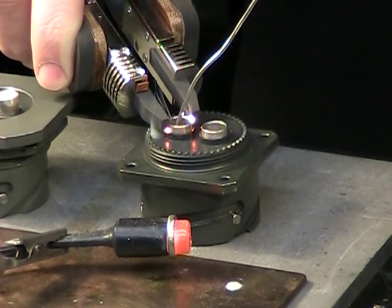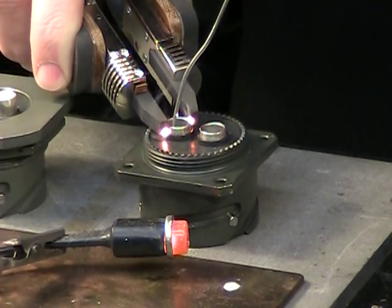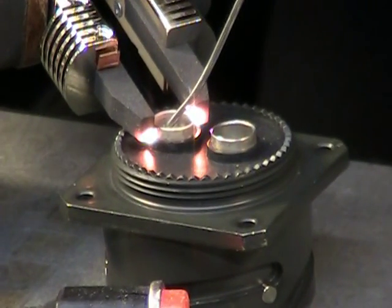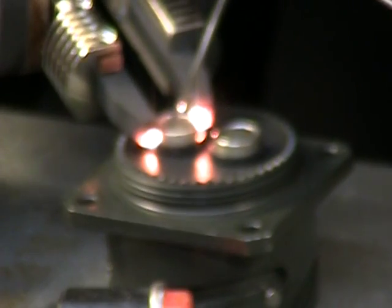which involves this slightly smaller handpiece for accessibility purposes. I'm heating this solder cup in order to fill it — I want to pre-fill it. These solder cups are a little bit shallow, which is another reason to have the smaller handpiece, because you're working in a much smaller, tighter area.